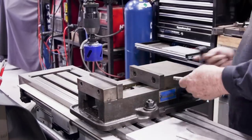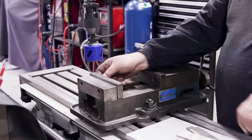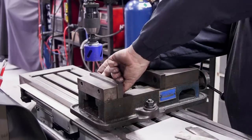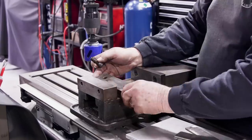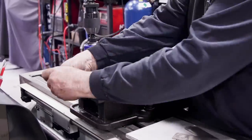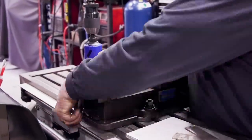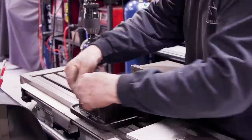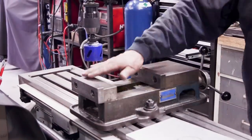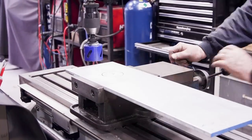I've never done this before, but my father-in-law, a retired machinist currently living with us, gave me this tip: if you run into this problem, you can always take the jaw off and stick it to the back side and that'll give you some extra space. That's exactly what happened here — I picked up a couple more inches, I only needed one, but it fit right inside there perfectly.